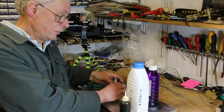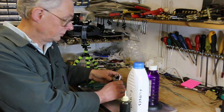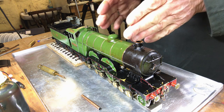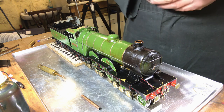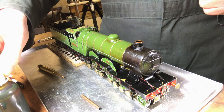Now let's get the engine out and get on with preparing it and raising some steam. I always like to fill the engine strictly in this order: the lubricator first, then the boiler with the tender, and then put the meths in. That way you will make sure you don't forget anything — particularly it's easy to forget filling the lubricator.